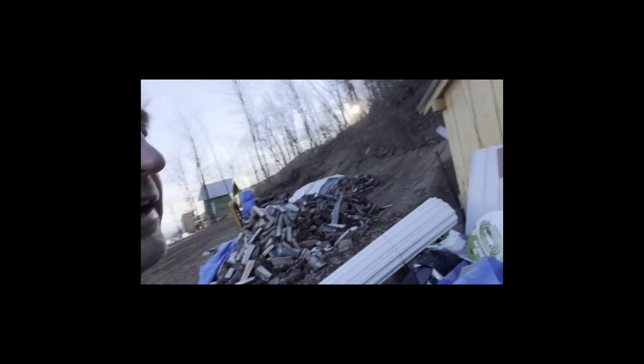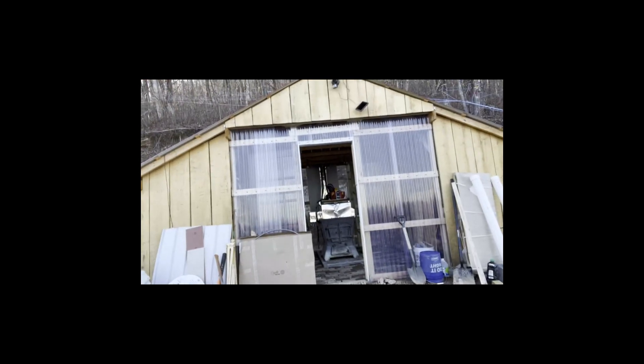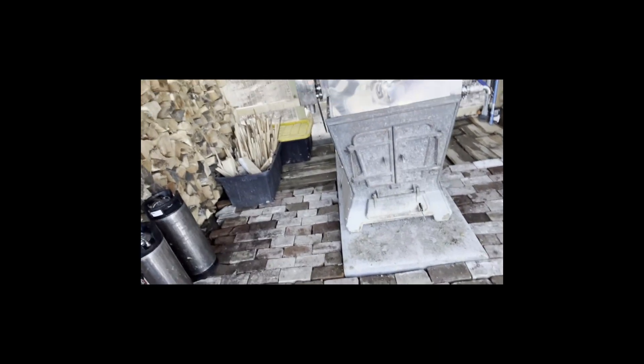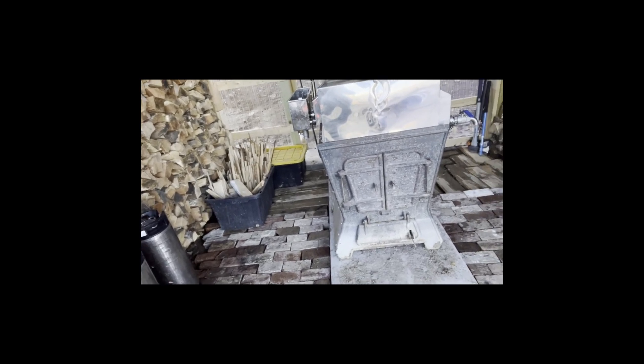The other thing I did this year is closing in the sugar shack. It's kind of a mess right now, but that's the front. Last year I had vinyl tarps — it was better than nothing, but not much. The other downside was it made the place dark; I couldn't see anything. So what I've done is used polycarbonate roofing panels, which is not the prettiest thing in the world, but it lets in a ton of light. You can see I've got my bricks. Unfortunately I'm on clay — when we first put them down I had about a half inch clearance with the door, but when I came back, the ice had heaved the clay up and moved the bricks, and I almost couldn't get into the sugar shack.